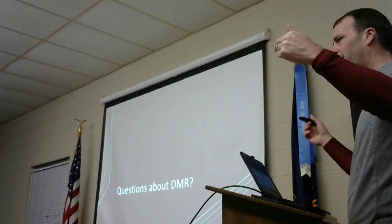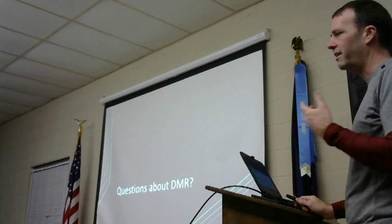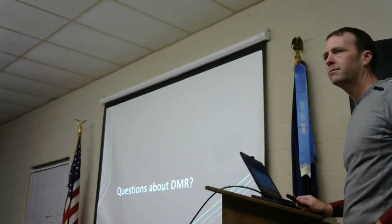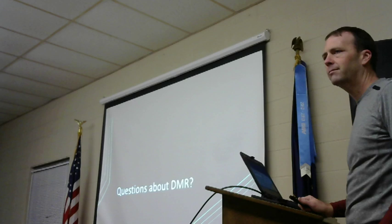As long as you're on a talk group on your radio and they're on the same talk group on their radio, the rest of it in the middle doesn't matter. Unless you're on the same repeater, then you have to be on the same time slot. That's why I was going to say it's specific to the repeater you're using and the one they're using, and it just meshes in between. The magic cloud takes care of that.